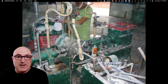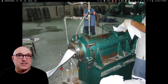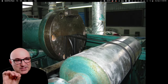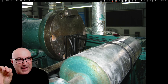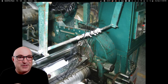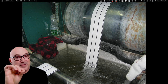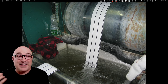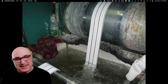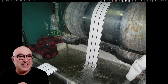Here they're making tape and sending it through a water bath to firm up. This extrusion machine has two different extruders — one produces the black strip. Those black strips get attached to the white ribbon so you end up with a white tape with a black stripe. That stripe is not painted — it literally is rubber, and you can actually peel it off because it's a separate piece of rubber, not paint.